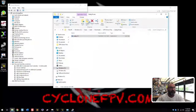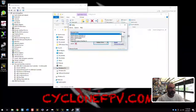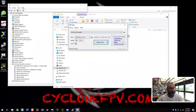And you're gonna get this option here, click yes. And you're gonna end up with this little pop-up that's gonna come up here and allow you to run their software. And here's how you're gonna do it. Here's your dialog box here. First thing you're gonna do is go to options and you're gonna click list all devices. From there, you're gonna drop down and you're gonna find that STM32 bootloader, okay? And you're gonna click that.